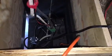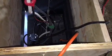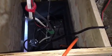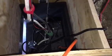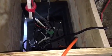And so when you turn off the projector, it turns off your 12-volt trigger, which will then cause your linear actuator to retract. And remember, you would not plug in your constant power or your common into that strip. You would plug that into another outlet so that it is constantly receiving power. Okay. So it can get a little bit confusing, and that's why I'm repeating myself, because when you're sitting down looking at your relay switch and you're like, okay, what supplies power? There's two power parts, the trigger and then the common, which is the constant power.